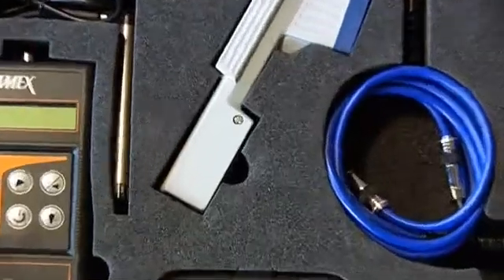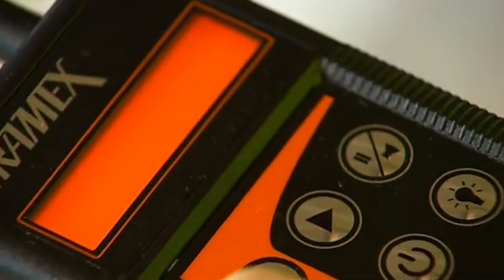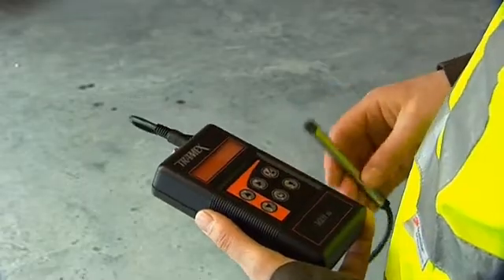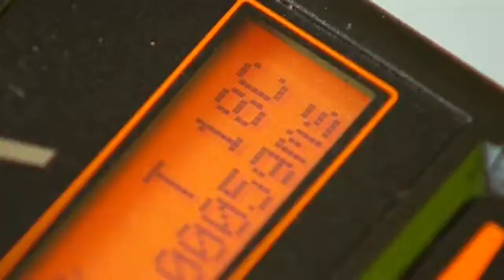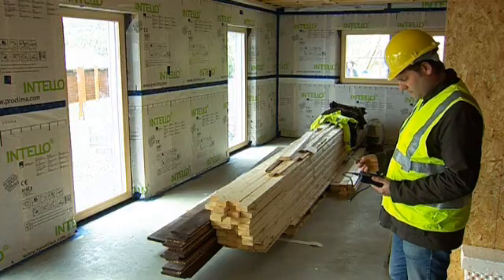The MRH kit contains a temperature and humidity probe which provides simultaneous readings for humidity in both percentage RH and grains per pound or grams per kilogram, in addition to temperature and dew point, and displays them together on a clear display.